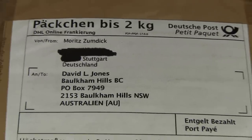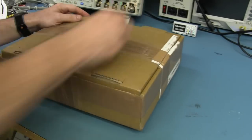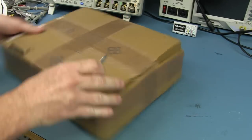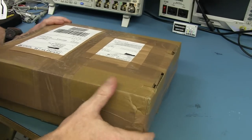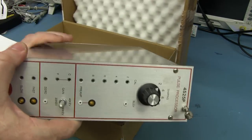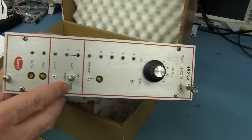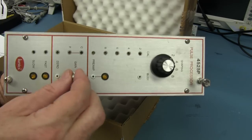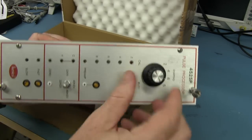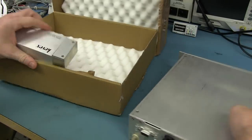Next up we've got one from Maritz from Stuttgart in Deutschland. Hi to all my German viewers, which I think is the second or third most popular country for the EEVblog. Let's see what he's sent. This looks like a pulse processor. 80 kV, 20 k, 40 k electron volts. Some sort of custom designed device for physics processing. Bias, out, power. Let's take a look inside — yes, it's from a scanning electron microscope, the EDX system.